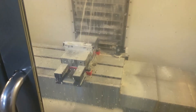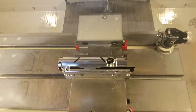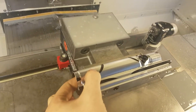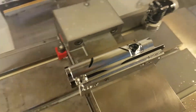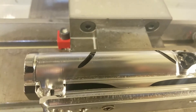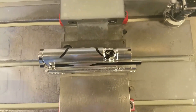You've probably seen that in some of my other videos. It's done! So this one's all done. It's interesting how this stuff kind of showed through — I don't want to go any deeper. My rule of thumb for making cosmetics that are very thin like that is I go about a sixteenth of an inch. So this wall thickness around the bolt bore is one sixteenth of an inch, which means this little cut that was done from the factory is probably another maybe one thirty-second of an inch closer.